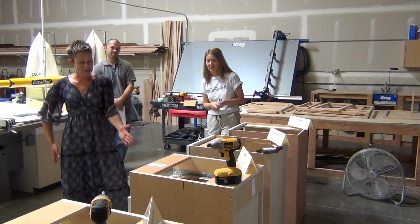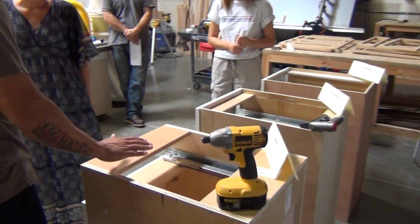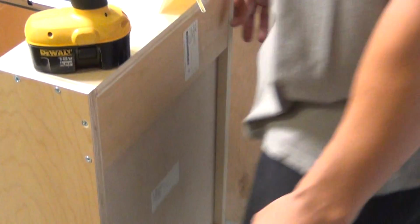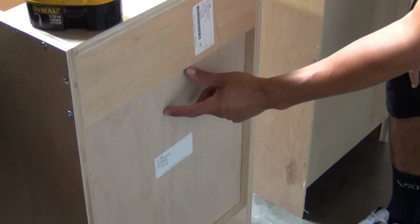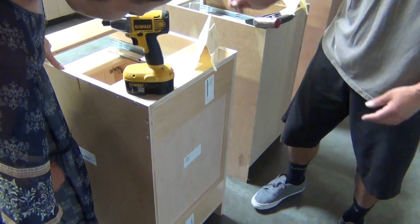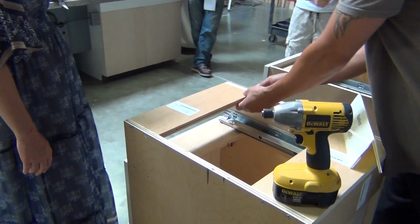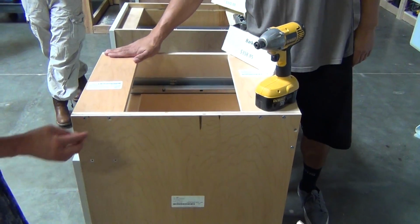Right. What about this one, Derek? Okay, now Barker Cabinet makes a really good cabinet here. This one is actually solid 3/4 all the way around, except for the back. In the back, what they did is put two 3/4 inch nailing stretchers, top and bottom, with a 1/4 inch integrated back that slides in the groove. This one is used with an 8mm Confirmat. These stretchers are pre-drilled for you, so when your assembly comes, you line these up and screw these in.